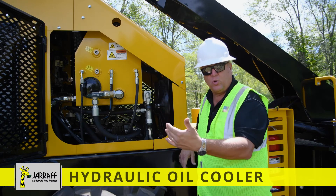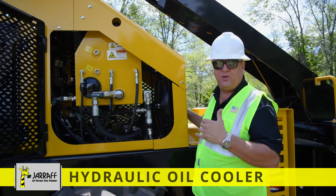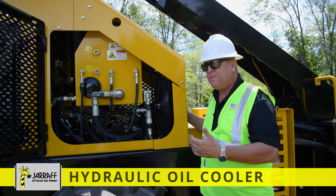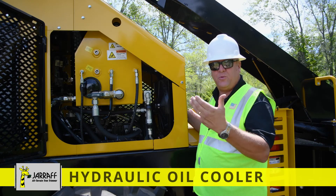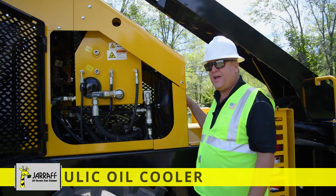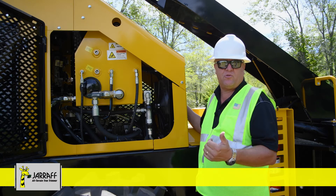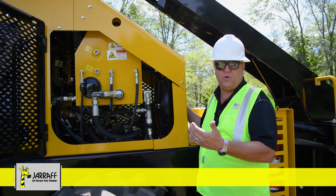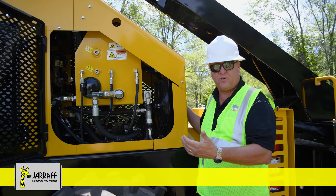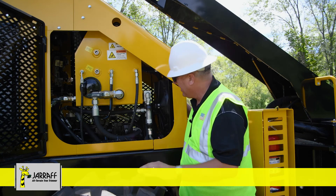This is for cooling purposes — you want to make sure this cooler is always cleaned out with no debris, no blockage. In the cab you do have a hydraulic temp gauge, and if you ever get up to about 190 degrees it's going to shut the unit off. The four main reasons for an overheating issue: first, the cooler is stopped up with sawdust, dirt, or dust; second, the hydraulic fan is not coming on — it usually comes on around 115 to 120 degrees, and if that fan's not working the unit will overheat; third, a possible stoppage of hydraulic filters; fourth, you're low on hydraulic oil. Those are the four things to check right off the bat.